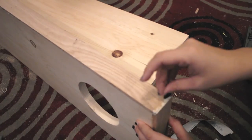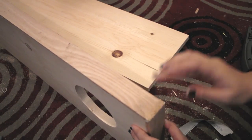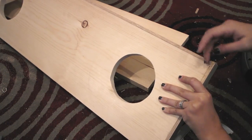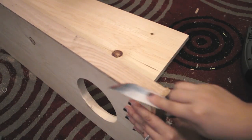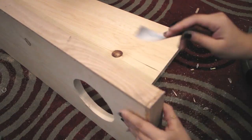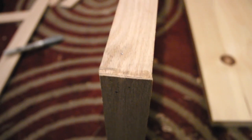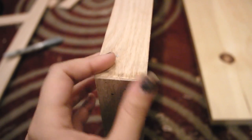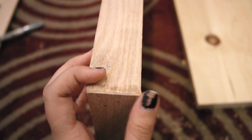You may have noticed I had a gap where the wood didn't quite meet perfectly. It's unfortunate, but thankfully it's fixable. You just have to squirt some glue into the gap, sprinkle some sawdust into it, squish it in, and then sand the excess glue away. So if you have this problem, hopefully you haven't cleaned that workspace just yet. It's not the prettiest, but it's better than having a gap right there. And for me, I stained them a dark color so you can't even tell anymore.